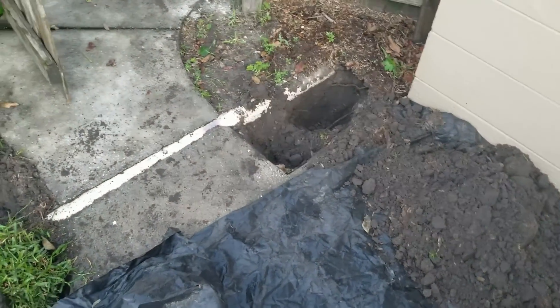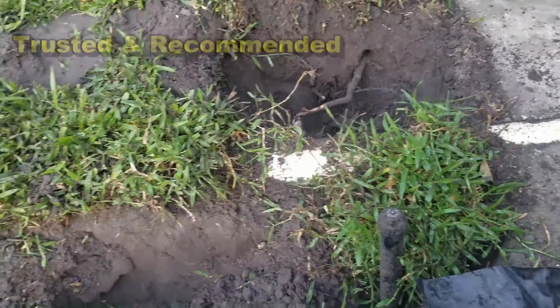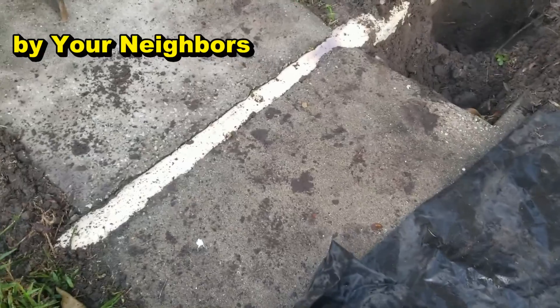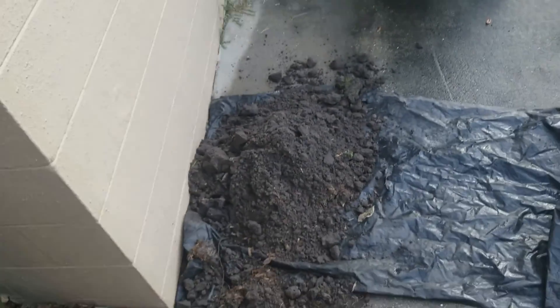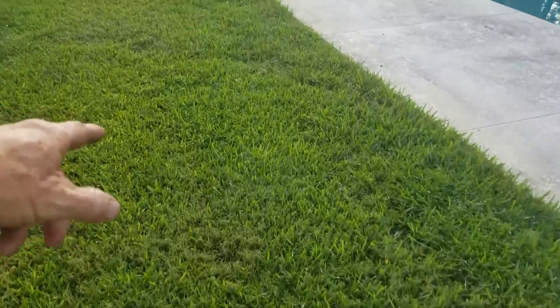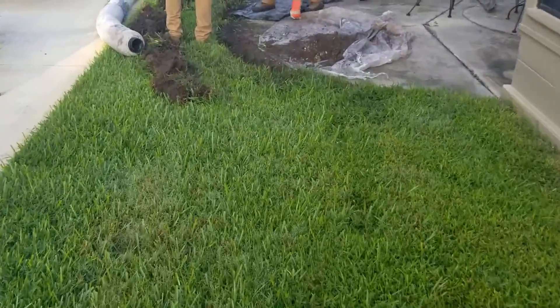So we started our excavation. Remember, we're going to tunnel the sidewalk, and you're always going to find obstacles in your way. Here we have a sprinkler line — you can see the white pipe on the other side. This three-inch pipe right here is from the washing machine. Some of these homes were on septic; you can see there's the vent for the washer. At one time they were on septic, now they're on sewer. We're finding this line as it runs all the way around the house — the old septic tank must have been somewhere over here — but it has long been hooked up to sewer. That line still comes all the way around, ties into the main drain, and goes out to the front. It's just an obstacle — still in working order, so we can't take it out.